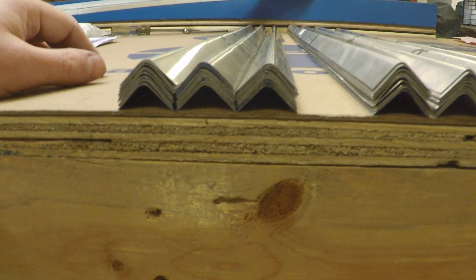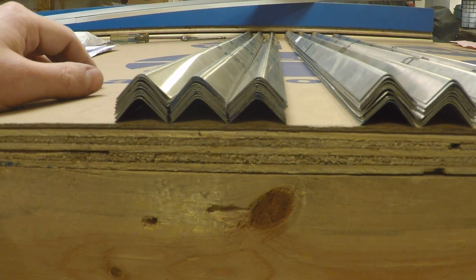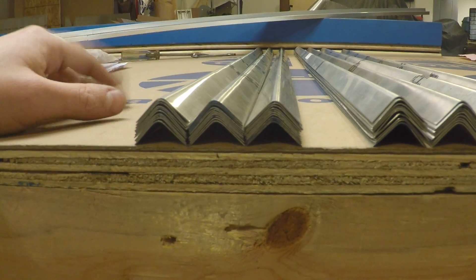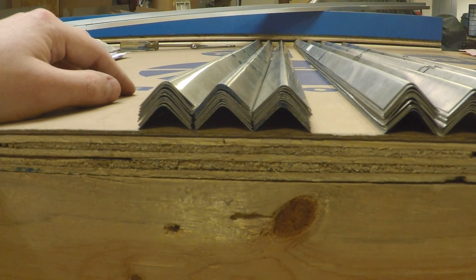There's no real good way to do it. One of the best ways to start building your airplane is to order a few sheets of 25 thousandths and just start making L, because if you do a homemade bending brake or even a factory bending brake, you really get to learn the bending behavior of the brake while making a fairly easy part.